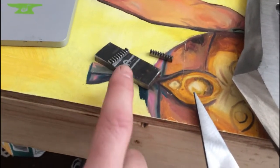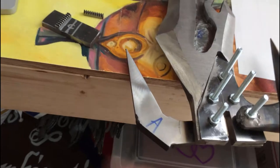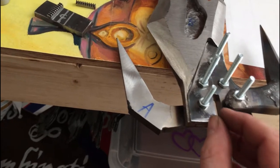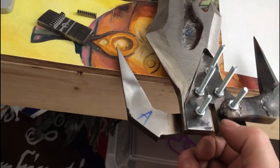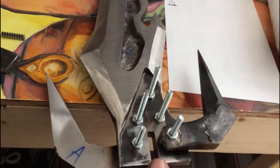So I'm going to go out and TIG weld these in place. I'll set the first one, probably take this out, slide it in there, and then tack the other one. And that'll give me the switch that will actuate this. And then I'm going to make a little lock pin behind it, and then some spring tension coming from this direction. So you can push against the spring, they'll come out, and this little lock device here will drop down.